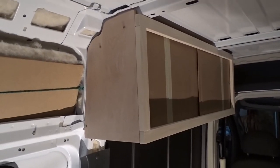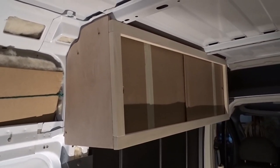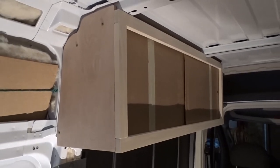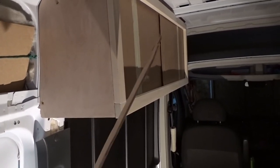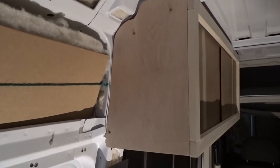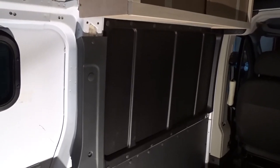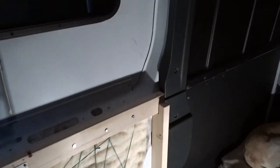I have put together the first cabinet. We're still trying to figure out what we'll do with the ceiling — I may regret having done this first, but we'll figure it out as we go. Everything is put together with screws so I can take it down and put it back up. Nothing is glued at this point, so I have flexibility. I did a cardboard template for the side, used a slightly heavier material, and then sanded a bit and tried to match it as best I could. We didn't do flat wall panels — we're going to cover the black plastic panels that came with the van, take them off, and cover them with our wool insulation, then put them back up.